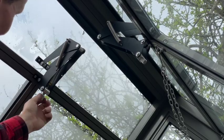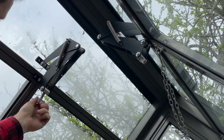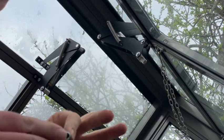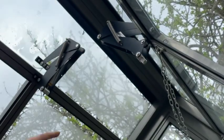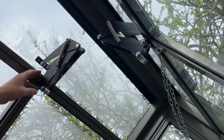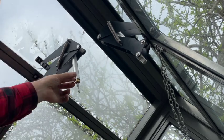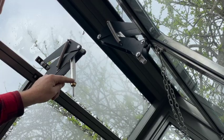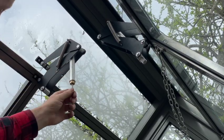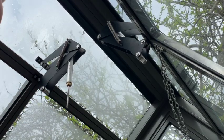I'm going to take this to pieces just to help identify some of the parts. The part I'm unscrewing at the moment is called an adjuster, and this adjuster is hollowed out to accept the piston on this cylinder. So there's the cylinder — that is a wax-filled cylinder. When it's warm, the wax in that cylinder expands, and that in turn pushes out this piston, and that is what opens your vents.